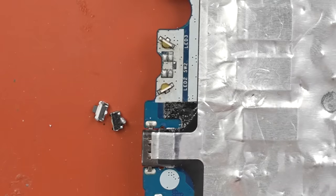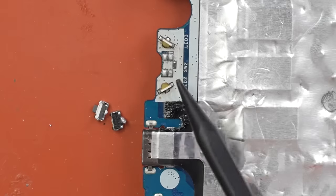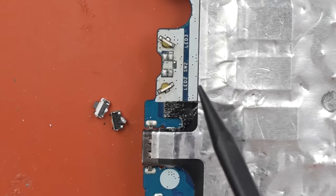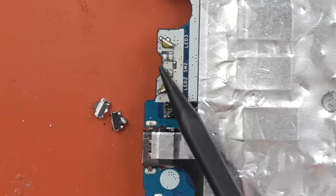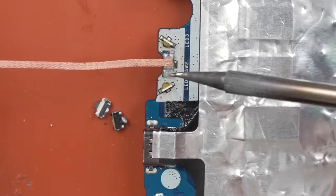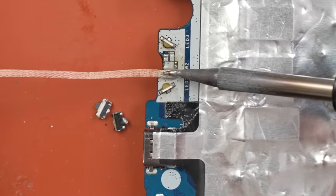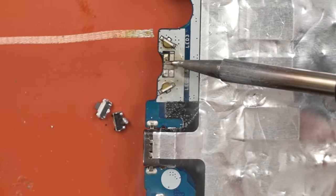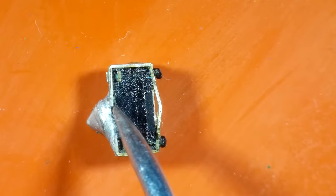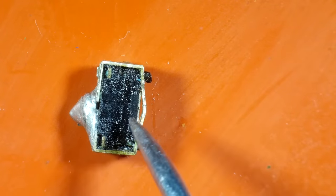The first thing we need to do is fix this little problem. There's so much solder on these pins that I don't think we're going to get this button to stick on there without bridging these points. So I'm actually going to remove this solder and then put a little bit of fresh solder on there. I'm going to use some solder wick and a nice hot iron — the wick will wick up the extra solder on these pads, making it much easier to install the new button. Looking at the old button, somebody definitely tried to fix it — there's a big blob of solder on the back side trying to get it to mount better.